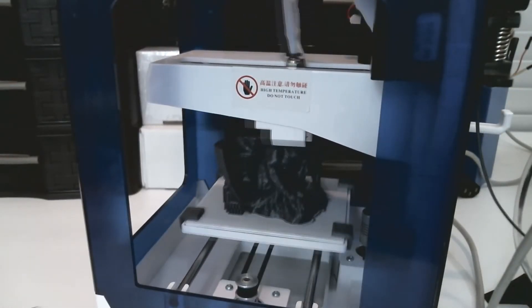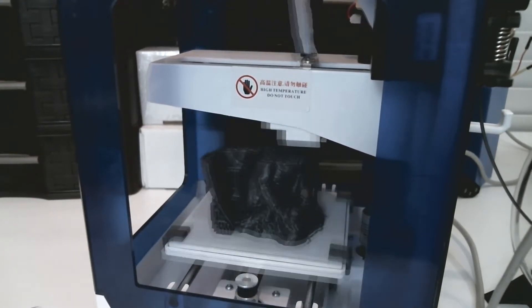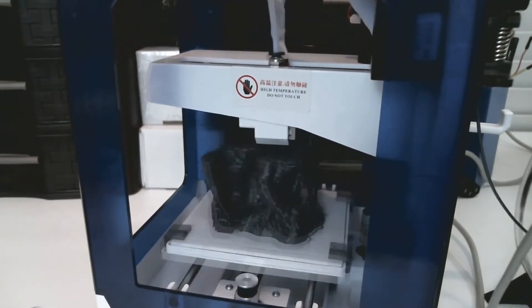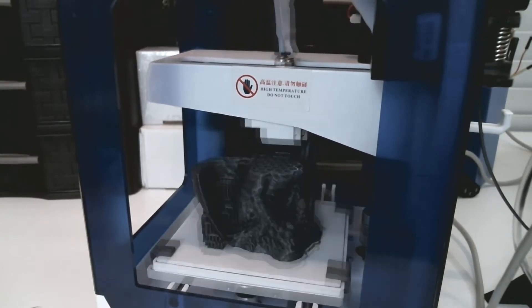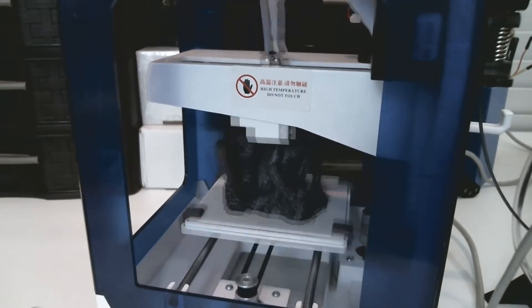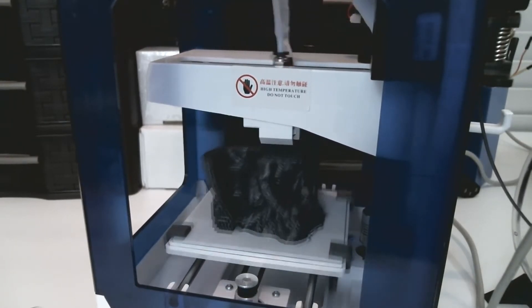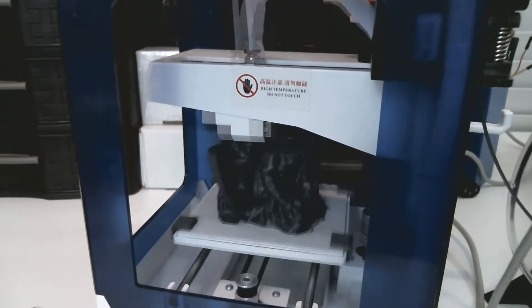In addition to all of that, the construction is considerably rigid compared to most RepRap-style 3D printers. This printer doesn't have a heated bed, but so far for printing PLA and PETG, I haven't had any problem with parts sticking as long as I use a few layers of glue stick. I haven't tried printing any ABS, but there really isn't much point in trying it without a heated bed.